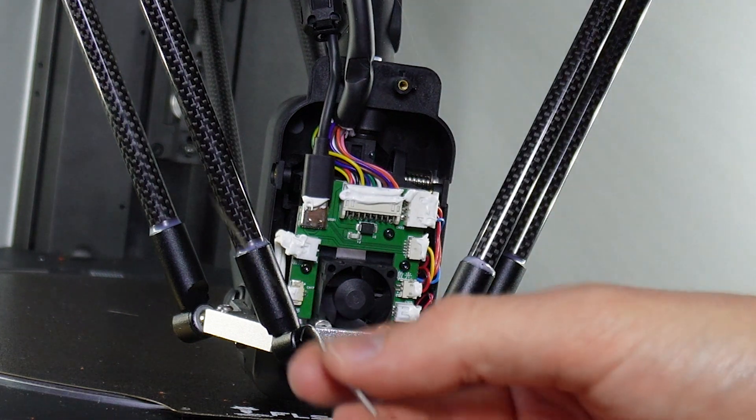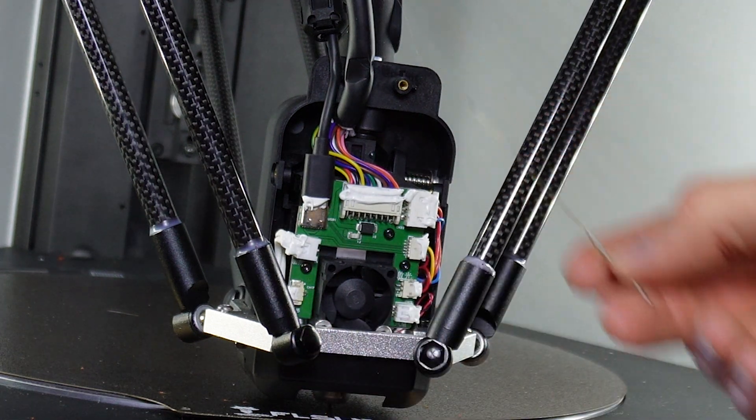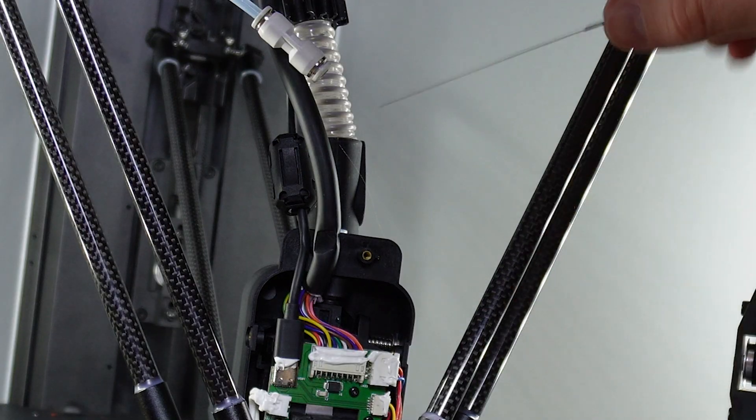It's been a few days since I recorded everything else. Now with the benefit of hindsight, let me go through the technical problems I've had and how I fixed them. The first issue was a clog in a very inconvenient spot — right above the extruder in the printhead. Because the section of Bowden tube attached to the printhead is short, I couldn't access the clog with my clearing needles. What I ended up doing was trimming the Bowden tube above the printhead to make that distance shorter, then I could stick the needle in and clear the clog. This clog was caused by printing non-high-speed PLA at extremely high speeds — I was warned against that, didn't listen, and got a clog. User error.